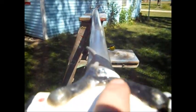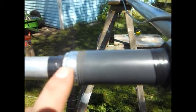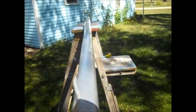I can make a video someday if somebody's interested of how I unbraid this cable to get the ground over here. And where I had a little bit of the white insulation that's over the center conductor, I put some of this foil tape to kind of act as a shield, like you'll see on TV coax. I wanted to shield this the best I could because I didn't want to bring the braid all the way up. You can bring the braid all the way up. I can show that in a video someday. You have the braid pretty close, so it's shielded. I want the signal not to bleed out anywhere but go right here.